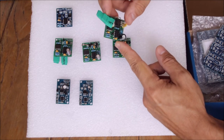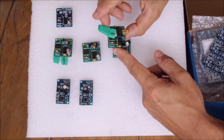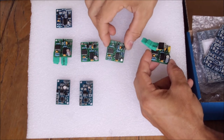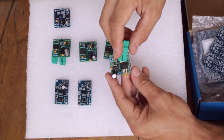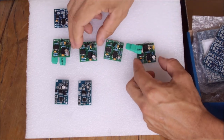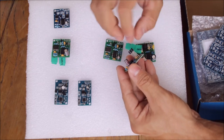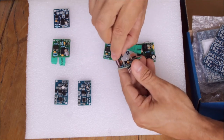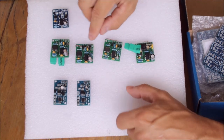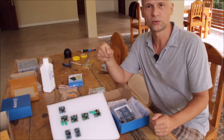All these are working boards but set up with different components. This one has been running my Powerwall for more than one and a half months and only reset it maybe once during that period. Instead of using the small signal MOSFETs, I placed large power MOSFETs and it worked like it should. I soldered the MOSFETs at the very end and removed the heat by holding them with pliers so the top did not get hot. It was unfortunate — those original MOSFETs were Chinese reproductions and the quality was very bad.